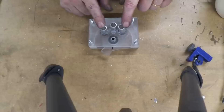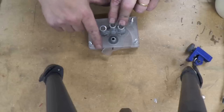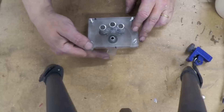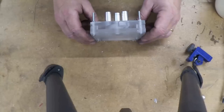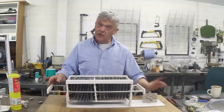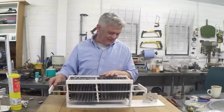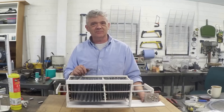That is the air inlet port and these two go to the piston. So when the valve's in that position, these two are joined up - this one exhausts out through there. So the valve will push the piston up with the other side exhausting out there. Now there's going to be a little knocker on that piston shaft, and that will knock it into position so that now these two are joined up and that exhausts. That's how we're going to actually make that piston work. I'm going to use that valve right there, so this will have a push rod on it operating the valve. And then we should be able to use this either on ordinary air supply or in a vacuum.